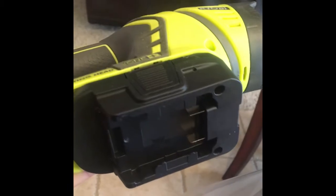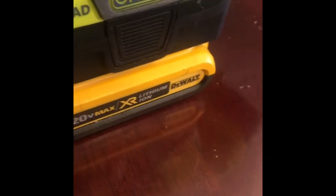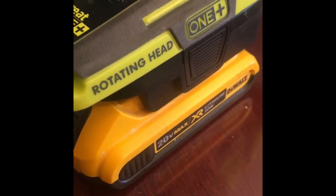So I'm going to test this configuration with the Ryobi light, because I feel like that would be the easiest and least noisy way to check it. So I'm going to go ahead and plug this in. It beeped 5 times. That's sensing that it is a 5S battery pack, which is accurate. I've just switched on the light, and in theory, this should start beeping when the voltage goes below 3.4 volts per cell, which is well within the battery's health tolerances. So we'll be back a little later to see how it goes.